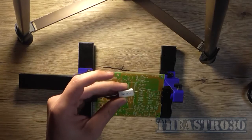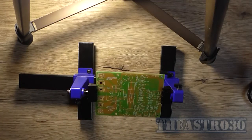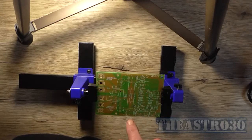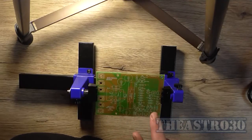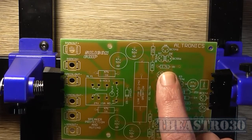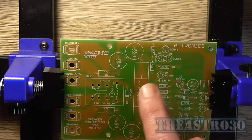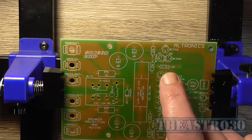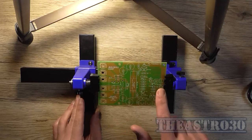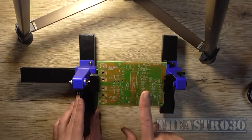It's the next day — I've been out and got my 470 ohm 5 watt resistor, so that's all set to go. I'm going to assemble this now. I'll start with the smaller resistors first, remembering that R1 needs to be changed to 4k7 instead of 2k7 because I'm running on plus/minus 35 volt rails. Then it's simply a matter of doing low-profile components — resistors first, diodes, then move up to larger ones like the 1 watt devices, the 5 watt device, smaller capacitors, and finally the larger capacitors and input/output connections.